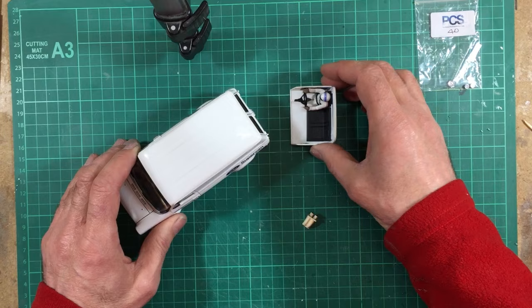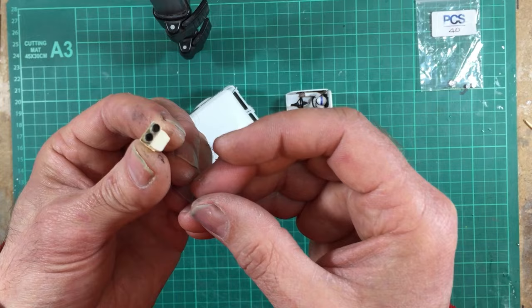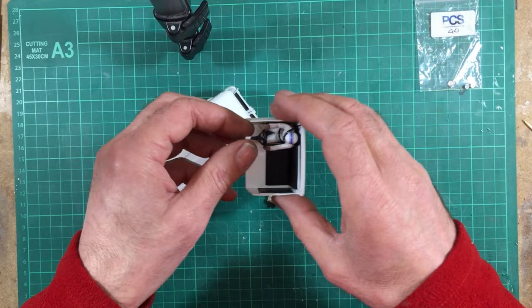Now it's very important that you put the interior in before you fit this tailpiece. When you fit this tailpiece into the body, it makes fitting the interior incredibly difficult. Now there is a way to do it if you're unfortunate enough to have fitted the exhaust pipe in first,